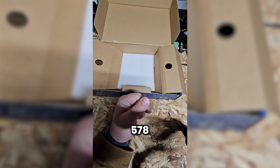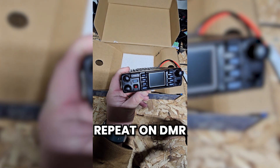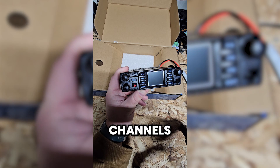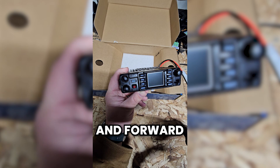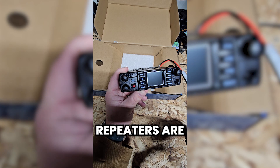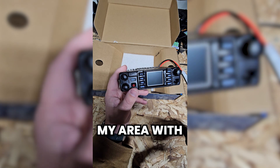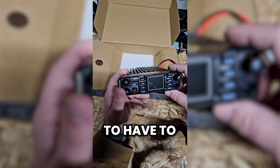I actually don't know if I'm going to mount this 578 in my truck because of the crossband repeater. I believe the 578 can also do single frequency repeat on DMR — a DMR-specific mode where the radio receives on one time slot and immediately retransmits on the second time slot. So it's not like a simplex store-and-forward repeater, but actually works like a duplex repeater, like typical amateur radio repeaters. If this works as a single frequency repeater, I can put it at my house and have my own limited-function repeater for my area with my business license. Having 50 watts over five watts would get a lot of extra range.